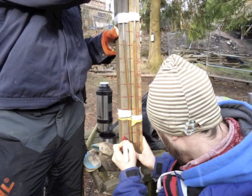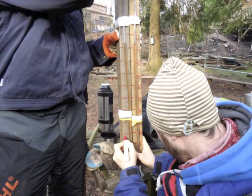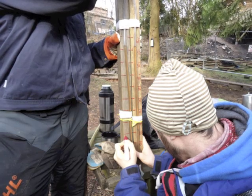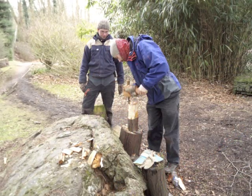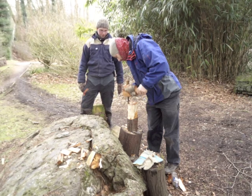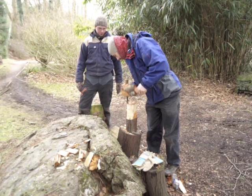Here we need to produce a bunyip to get a level so that all the stones holding the posts are level. This is a piece of clear plastic tubing with tea in it, and it's been calibrated in 5cm gaps. The clear plastic was 5 metres long.